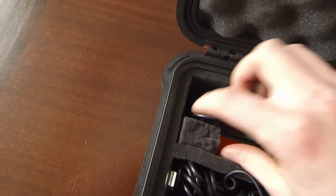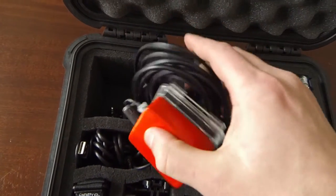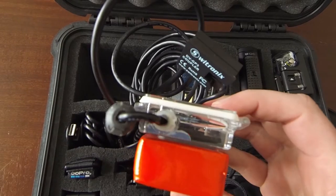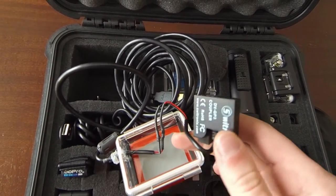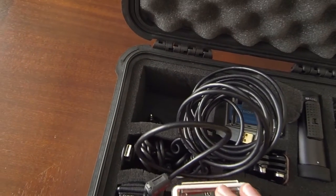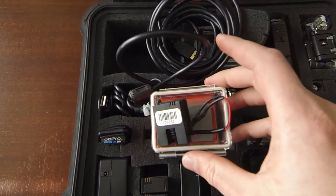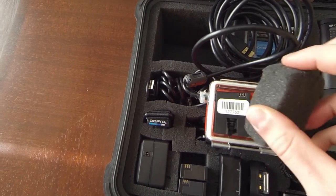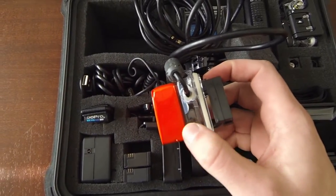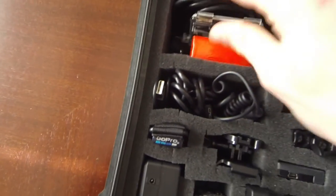Over here is that one item I told you guys I needed space for. This is the battery eliminator back door I put together, with a floaty attachment on there. I took a regular back door for the LCD backpack, popped the button out of the side, and ran this battery eliminator from Swishtronix through there with some heat shrink and solder to make sure it was a really good connection. This cord runs all the way down my panfish pole into my storage where I keep my portable battery. This foam I use to squeeze into the actual back door when the camera is on there, because it's flush with the back of the camera and there's a lot of free space that needs to get packed out so the camera doesn't slide within the case. My tripod mount I just shove down there as well.